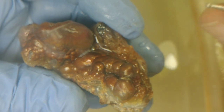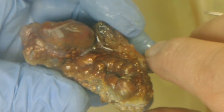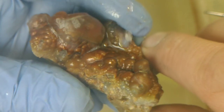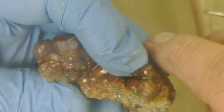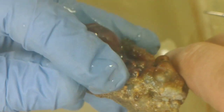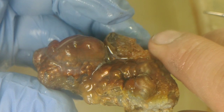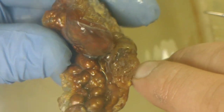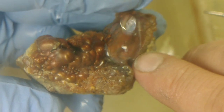At this point in carving, I hope that you're observing some basic safety precautions. I hope that you're using a mask — at least I like to use a 3M respirator. Any N95 series mask or better will keep the particulates out. You don't want to be breathing silica dust; it can lead to silicosis and some other nasty conditions.